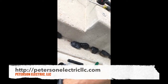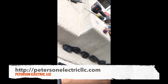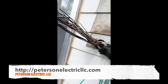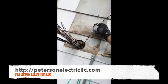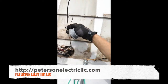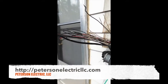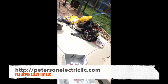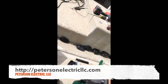Here is a two-inch metallic chase nipple I'm using — this will sleeve and choke these wires. As you can see, I've already twisted these wires together because code says we have to identify our neutral, so we're just keeping that twisted. I had to straighten every one of these out — they were all bound up, grounds and neutrals together. It was really bad, so I'll get all this put together and slip this over — it goes on the back of the panel.